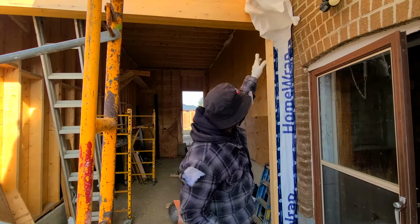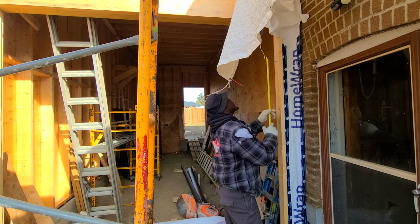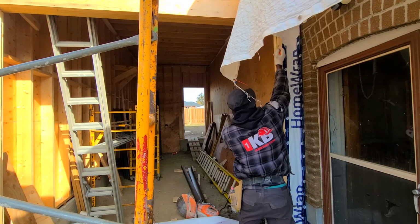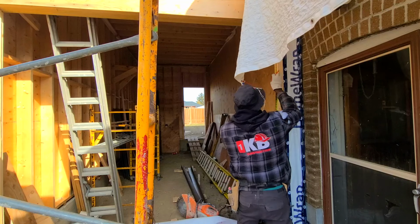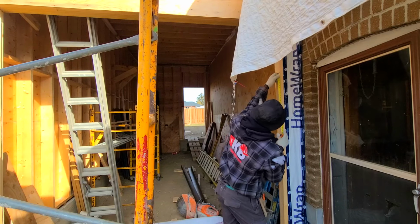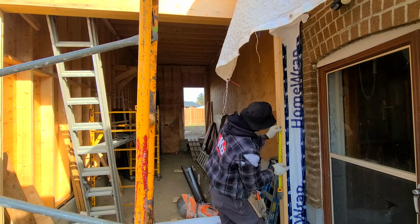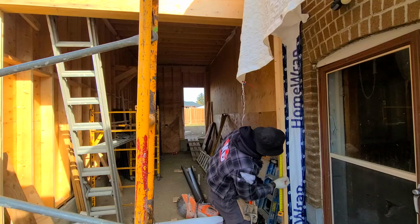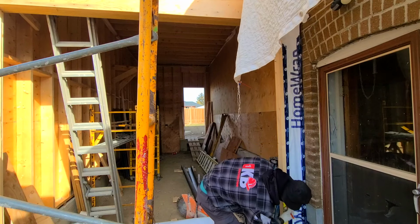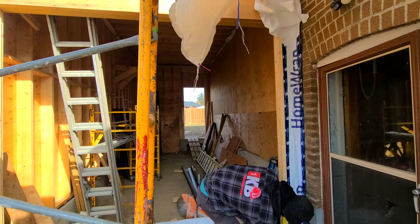Finish our insulation installation, we're going to measure from the top, come all the way down. Just going to keep on marking and change. Just mark off an inch joint right down to the bottom. The reason why I'm marking 10 inches is because 10 inches is the biggest size stone I have. You want to do this so that way you know whether or not you need to put a cut. If you take a mark and you need to put a cut, you want to put the cut at the bottom of the foundation ledge rather than go all the way up to the top.